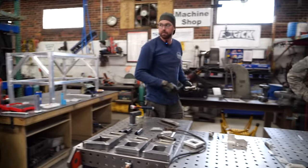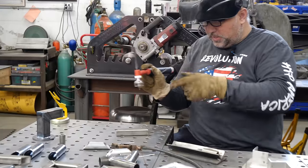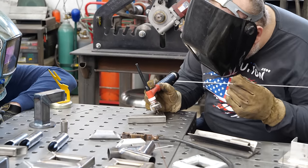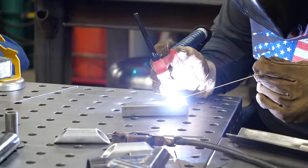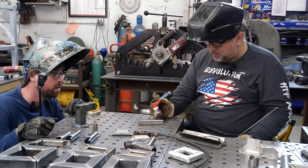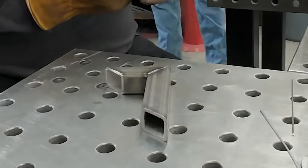That's a lot of stuff I've never seen before. You got a small piece of mild steel or stainless steel just for me to run one across? These little bits are stainless. So you want to grab a helmet — I'm going to do as if this was titanium. You would light this up and then you would have a post flow. I'm going to light it just to keep the post flow going. See, I'm already losing shielding gas — I want to do less stick out on this. See how it turns blue.